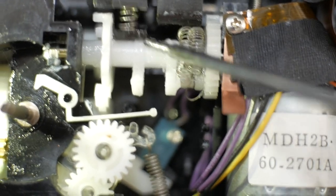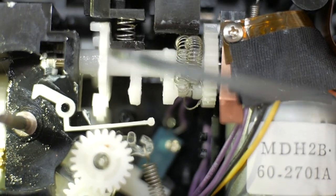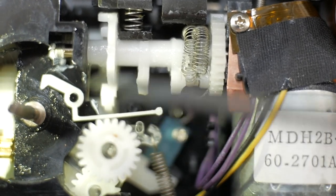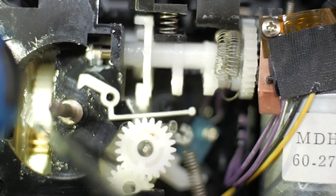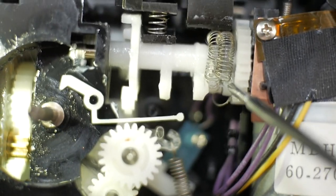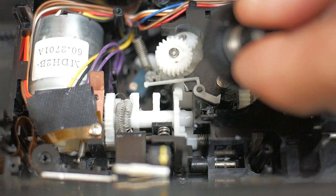I also cleaned off the old lithium grease and re-greased the whole mechanism — it's like a cam operated by a motor that pushes the printhead against the paper. I've taken the left-hand spindle for the cassette off, re-cleaned the shaft and re-greased it. This gear driven by a brass gear off a motor — I cleaned this whole sprocket as well and re-greased it, putting fresh lithium grease in place of the old stuff.